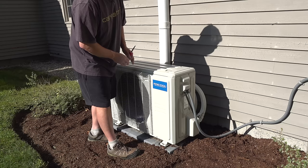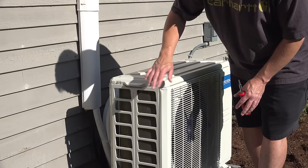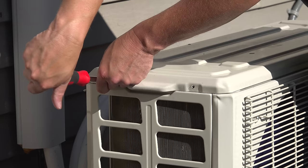We don't have to take the entire thing apart — don't go any further than you need to. I'm just gonna remove this top cover and that should give me access to the inside portion I want to clean. Here we can see we've got a couple of exposed screws — this is what you're looking for. Don't start getting pry bars and pulling on anything; you will damage the unit.